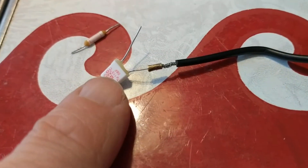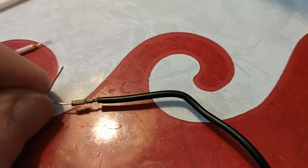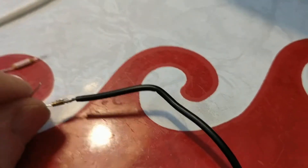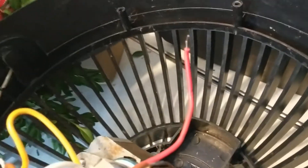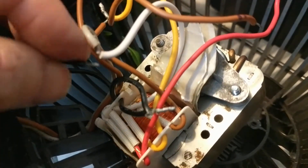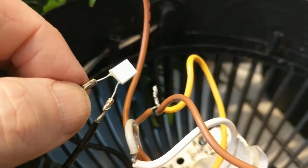I have cut the leads off this fuse and crimped it with the wire. I just opened up the original crimp, put the two wires in, and crimped it back again. It seems okay. I've managed to squeeze the other lead of the fuse into that little crimp so it won't fall off, so I can now place it on the black wire. I had taken photos beforehand to make reassembly easier. I crimped it in place and it looks like it should be good enough.